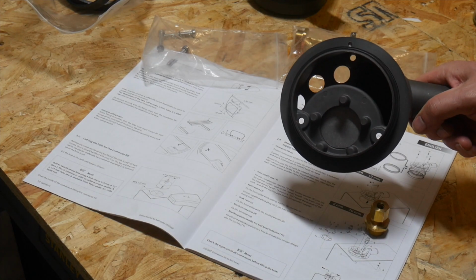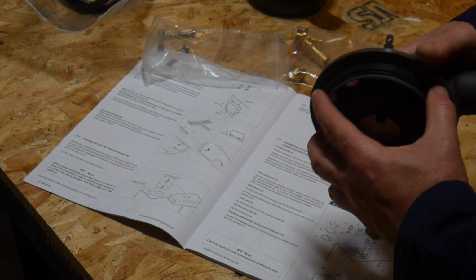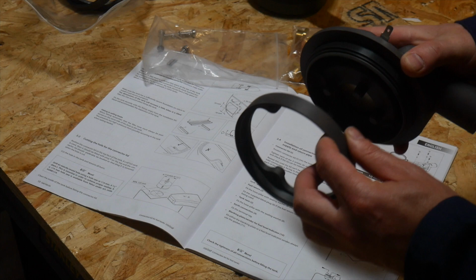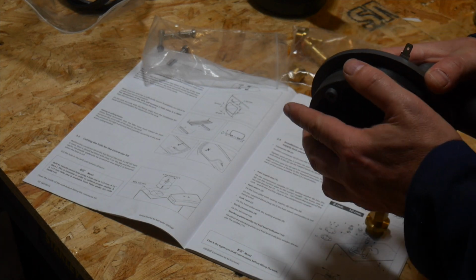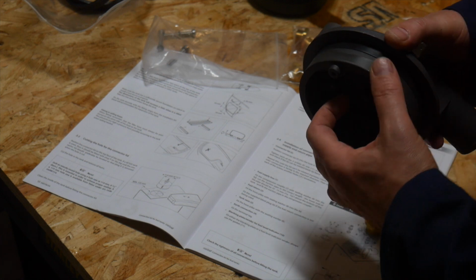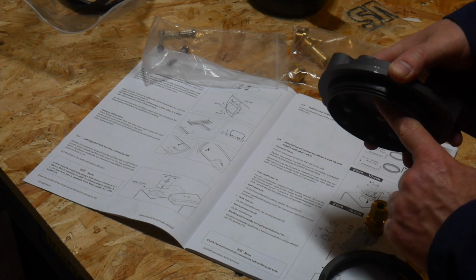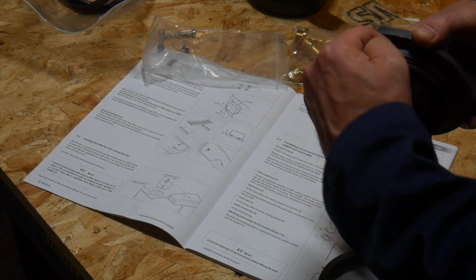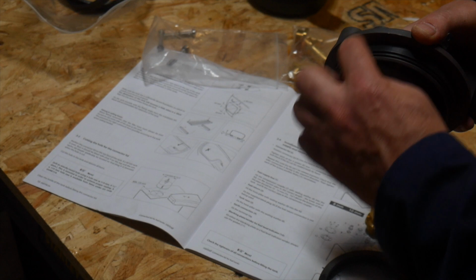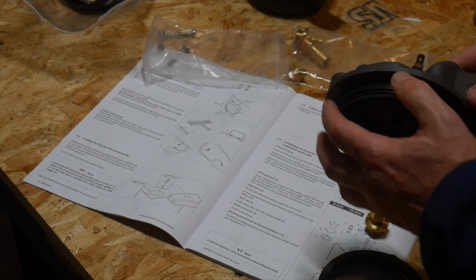The way they work is also quite nice. All you need to do is cut a 114mm hole here. There's a rubber gasket here, and there's a second part here that's got three screws that will go through and clamp these together. And I think you tighten this up and this compresses it, and then this rubber will bulge, and as it bulges out, it'll seal against that hole and also pull the top down to sit nice and flush.